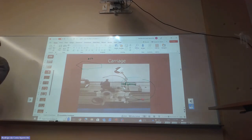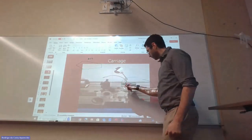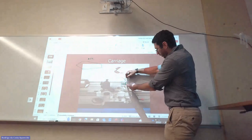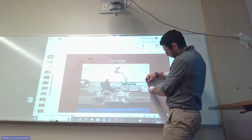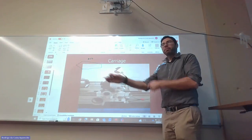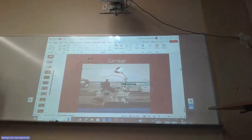And then the only way for you to pull it out, how do you guys pull it out? You have to pull this guy all the way back, because there's a drawbar here at the center. As soon as you bring this all the way in, imagine when you get here, this drawbar is going to hit the back of this thing and it's going to push it out, right? So the only way to take that off is you bring your tailstock back. Then the drawbar is going to hit the center and it's going to come out. And then you have to move forward so you can put the next thing in. Otherwise, you're going to be hitting the drawbar in there.